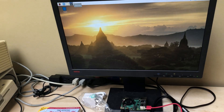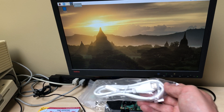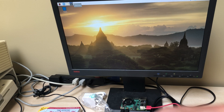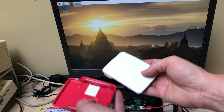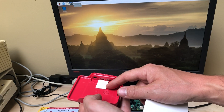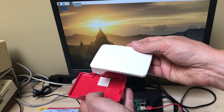In this case I actually used a DVI to HDMI adapter — those are readily available on Amazon. We might start selling them because they are super handy. The last thing: the case. The case is pretty straightforward. The only thing I don't really like about this case is there is no provision for cooling, so you probably want to run it with the Pi without the case top on, or you could drill some holes in the top.